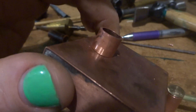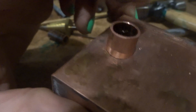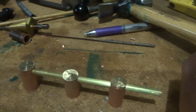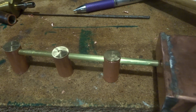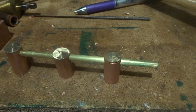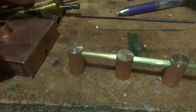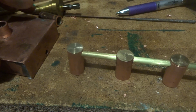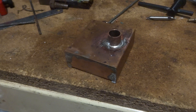I've also cut a piece of tube with a shoulder on it to go in here and turn the shoulder. That's the filler cap — or the filler pipe — probably not particularly necessary, but it's on the drawing so it's done. Next job is to settle this up on a nice flat, heatproof surface and get it soldered up. So that's the first job done: the filler pipe soldered in.